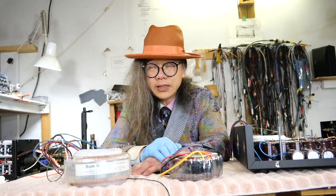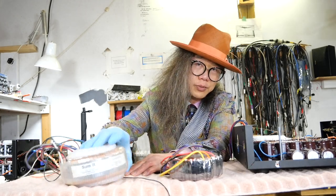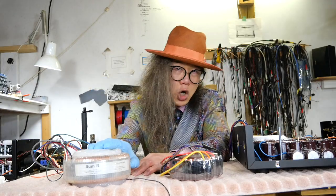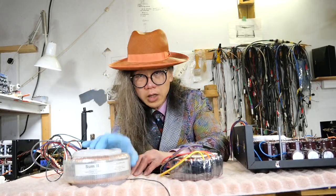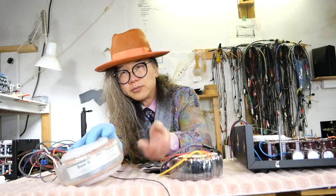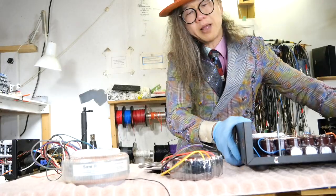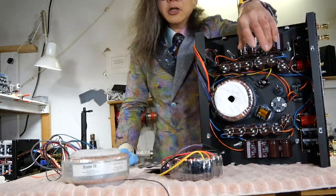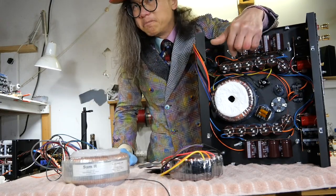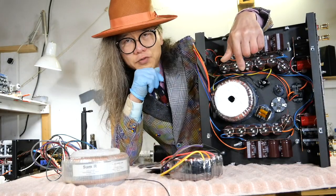Now, silicone — after I put the silicone on top and bottom of the transformer, it's not just that. I don't rely on the bolt to hold it on the chassis. I put another coat of silicone before I mount it on the chassis. This is an amp partially done that has the transformer mounted on the chassis. It has been one week — actually after two days you can do this and the silicone will hold the transformer.